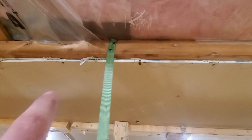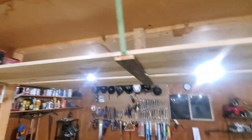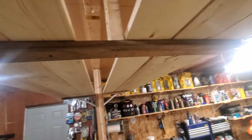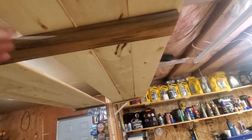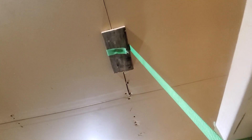Figured if anybody was curious, I could have done the same here — gone around a board up there and wrapped it around the same way and screwed it on. But I forgot to, and this is plenty solid enough already. I'm never going to put more than probably 200 pounds on the whole thing, and me and Frankie could probably both be sleeping on there at the same time. If you want ideas for hanging suspended shelving, even without this brace — if you were to use 2x4s instead, you could easily use these two straps and they'd be good for 500 pounds or more. Whatever these boards will hold, you'd probably be good for. Even if you didn't have a 2x4 to bolt it to, even if you just used the 1x4, I bet you'd probably still be good for at least a couple hundred pounds.